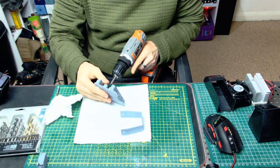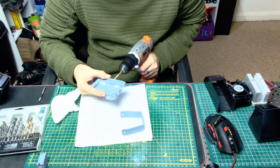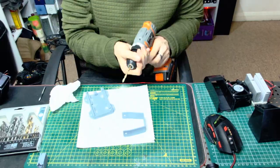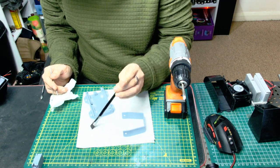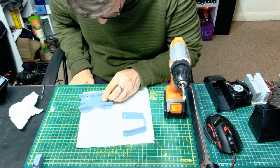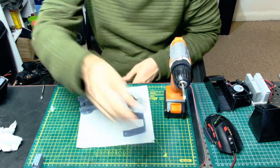All of these pieces, obviously, have to be tapped so that they can have the relevant screws and the like fitted into them. I'll make a few minor mistakes with the drilling of holes and tapping of holes here, where I cracked the 3D-printed plastic, and just a quick patch job with some liquid resin and hitting it with a little bit of UV light is usually enough to fix any of these small discrepancies.